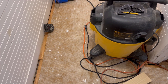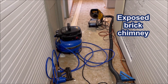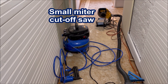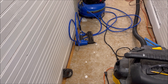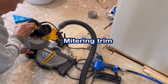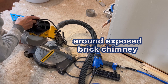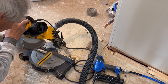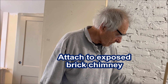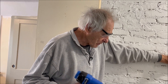These are my tools that are cluttering the upstairs hallway at the moment. That's the shop vac in the foreground. If you follow the hose, it's connected to my small cutoff saw — that's to minimize as much sawdust as possible. To the left of that is my compressor, and that's my air staple gun that we use to adhere both the baseboards and the ceiling molding. What I'm doing is I'm mitering this piece of trim — what I call a picture frame surround — so I'm cutting this on a 45. I just cut this 45, and I'm going to attach it to the bottom part of the other 45, and we're going to create that picture frame. I'm going to use my brads, about two-and-a-half inches long, and they're perfect for this operation.